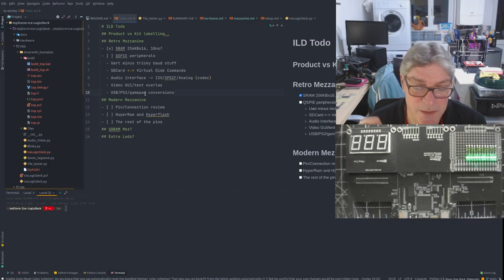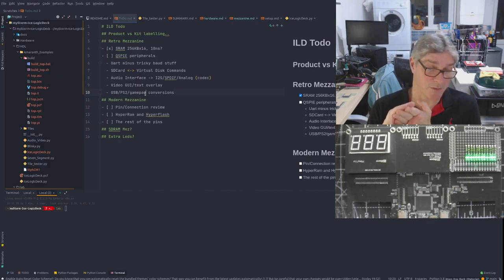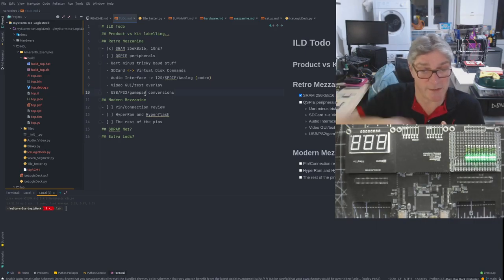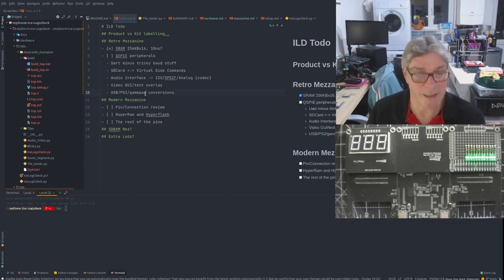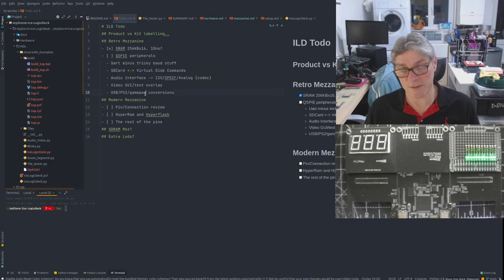I mean, if you use USB-C, you've got two D plus D minus connections that you normally connect together so that you can reverse it, right? You've got the sideband channel, which is another two. You've also got the CC, but those tend to be pull ups, pull downs. But you could theoretically do, just using those pins, 1, 2, 3, 4, 5, 6. You could do 7, 8, depending whether you want to break the USB standard. You could easily do 6 just using the D plus, D minus, 1 and 2 plus the sidebands. That would be 6 pins.